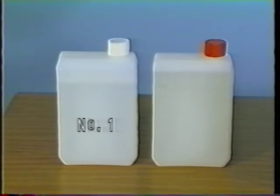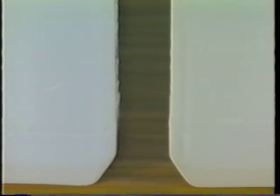Use Juki New Defrix Oil No. 2 or spindle oil No. 2. If a low viscosity type oil that is used for lock stitch machines is supplied to this machine, the oil may soon run out or oil leakage may result. So be careful.